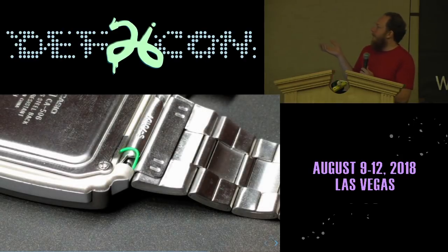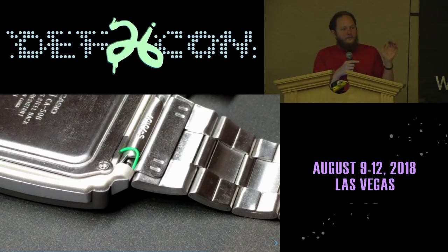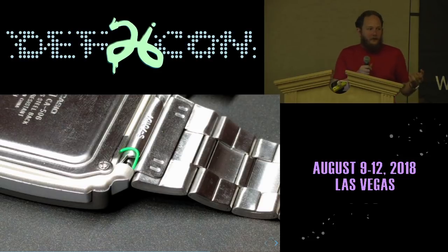I needed an antenna. So this little green wire here in the back actually connects the watch band as a random wire antenna, so that the watch band is the antenna for all reception and transmission. This is not a very good antenna, but it is more than good enough. In tests, we were able to transmit Morse code across 4 city blocks in West Philadelphia, received indoors.